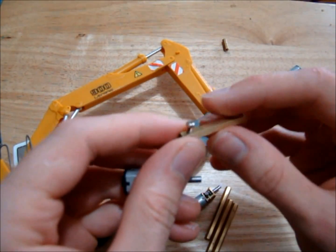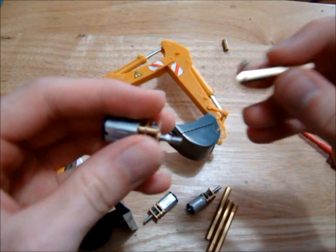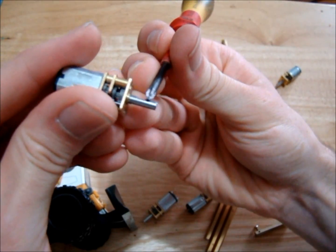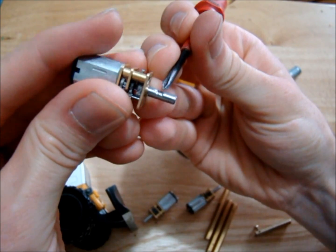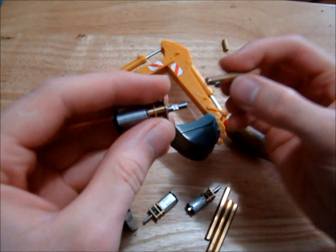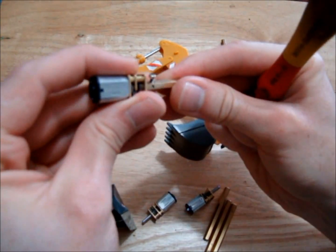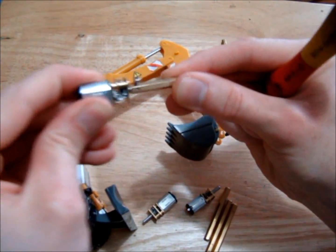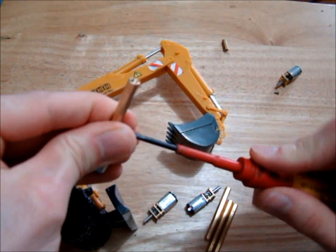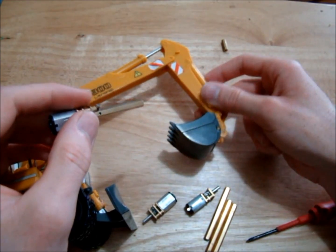After the first little part is done - I drilled the hole through, tapped it, and brought our screw through. It's an M2 screw. I cut a section out of the output shaft - it's a little bit hard to see on camera - so that I can put it on and tighten the screw into that notch so it can't come out. Our screw mechanism is now fixed in place, so no matter what we're trying to pull with our boom, this shouldn't come off. It's more likely we'd break the plastic boom than pull this off.